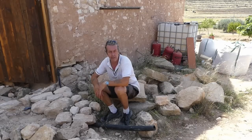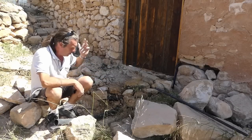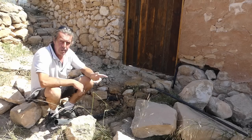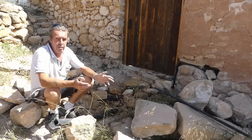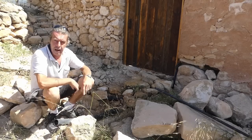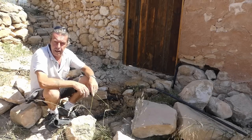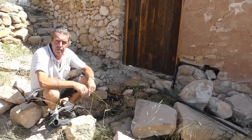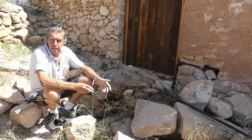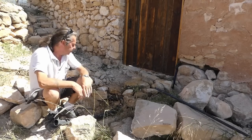grafting, slaving away. Right, okay, so I've wet the whole area down, and the first mix is coming. Shannon's going to be firing mixes at me. We need to move pretty quickly because we don't get long in the shade here. As you can see, it's here now, sun's coming round. It's supposed to be 38 degrees C potentially today, which is about 100 Fahrenheit, just slightly over. So it's not good for cement if it gets to that temperature, so we want to get it in before it gets that hot. So let's get cracking.